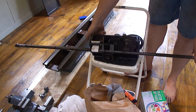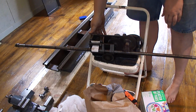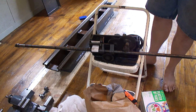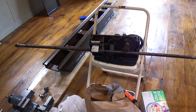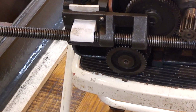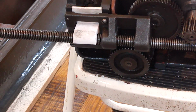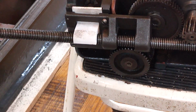The pin's not lined up, but it shows that it is working. The pin on the handle and the pin for the taper pin is off. But it is working. So now I'm going to print out another one without the slot in the bottom of it, and do it as lost PLA casting. I'll probably do two of them at a time to get it done up.